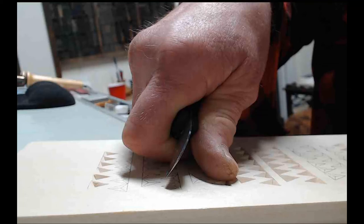There will be times when you're chip carving when you'll need to angle the cut in the opposite direction. To do this, roll the knife over in your hand and place the joint of your thumb on the side of the handle. The joint of your index finger will fit into the notch on the other side of the handle. With your thumb and knuckle still in contact with the wood, you'll still be able to generate a consistent 55 to 65 degree angle.